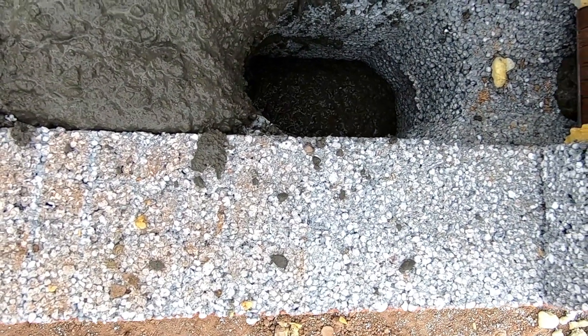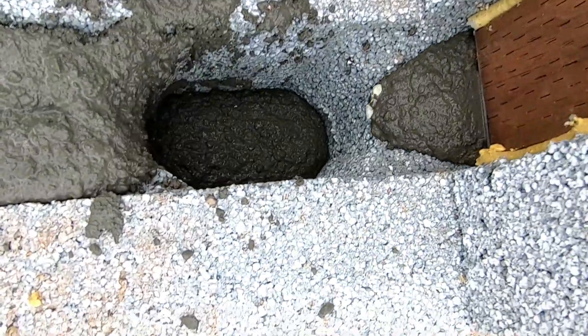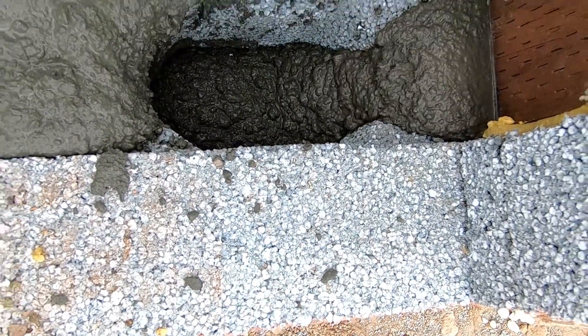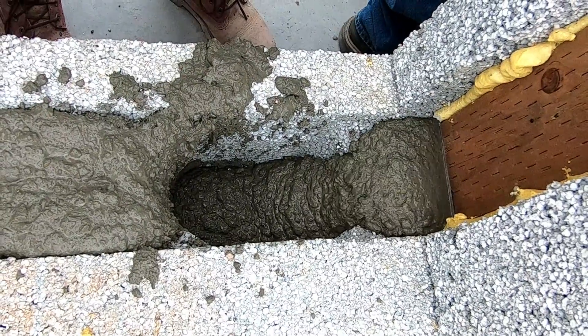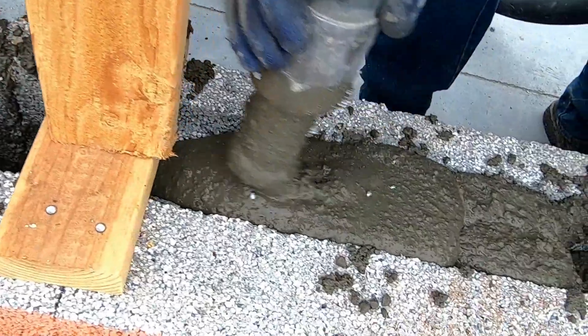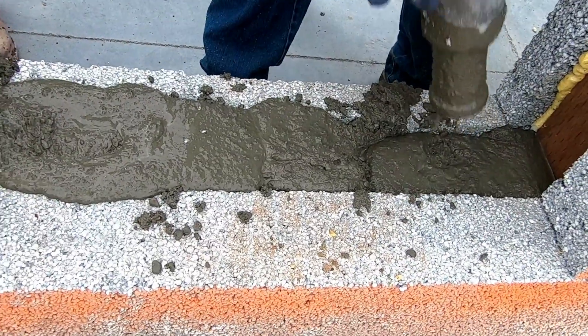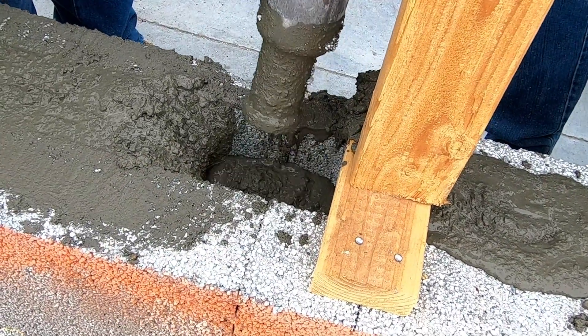You can really rest assured when you finish one of your jobs using the Perfect Block that you truly did a hundred percent for your client — or for yourself if you're doing this for yourself. You can see how it blocks up on the sides of our buck, and then you're going to see us top off the sill right here and trowel it off. When we go all the way around to the other side and come back here on top, this will be set up so there won't be any grout blowing through the windowsill.